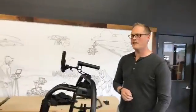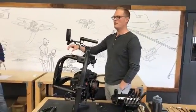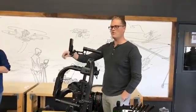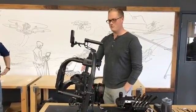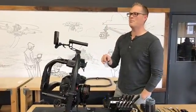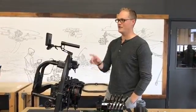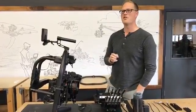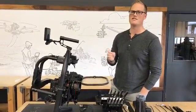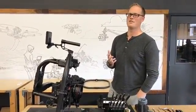Can you clarify what you mean by that? That one. It's an output. So if you were to plug something in that had 12 volts going into the D-Tap, which I don't know why you'd be doing that, I believe we're protected for that. But if you wired up a custom connector and got the polarity wrong, it would be sending out 12 volt output there. There might be some overcurrent protection where if it senses an instantaneous short, it shuts it down after a certain amount of time, but it might damage your thing.